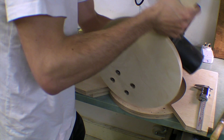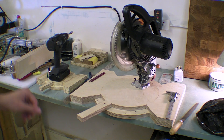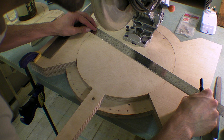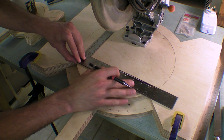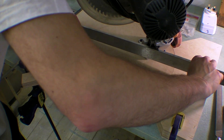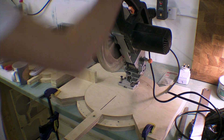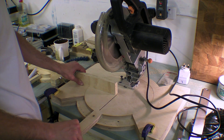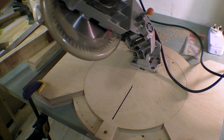I now need to make and attach the fence, but before I do this I also need to identify the centre of the turning component. From that mark I'll be able to work out how thick the fence can be. I ran into a new problem related to how far the blade plunged into the turning component — the miter saw is too far forward from the centre and turning the blade means the cut line travels. This is coincidentally the same problem I have with my table saw, making measurements incorrect when cutting with the blade tilted. I'm going to cut some other fixings into the turning component to hopefully correct it. It's a little annoying but I should have really done this with some scrap material first.